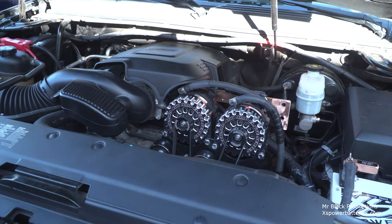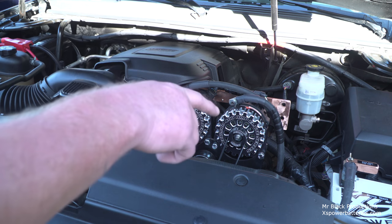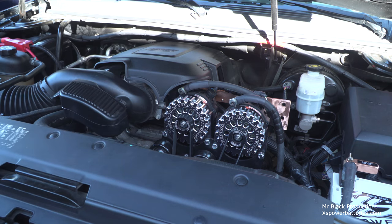The cable that we got is really heavy, a little bit big. It's almost an inch and a half across. It's 500 MCM. I didn't think about it. I got a little cocky and wasn't thinking too hard, and went ahead and invested in getting this wire. Somebody donated it, the whole nine yards. This is going to be a bit of a challenge to get maneuvered around everything underneath the truck, as you'll see here in a moment.